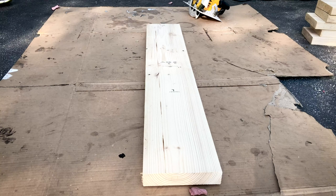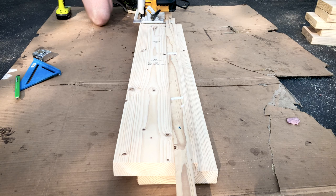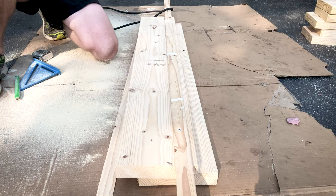Moving back to the 44-inch pieces I cut earlier, I'm going to do the same thing I did to the 12 and a half inch pieces — ripping down the sides to create nice corners so the boards can be nicely joined together to create a smooth surface. Since these boards are 7 and a quarter inch wide, I'm going to measure 7 inches from the other side to make one cut, then flip it around to rip another quarter inch off. This will create four 6 and 3 quarter inch pieces, so my overall width of the table will be around 27 inches wide.